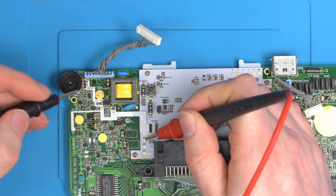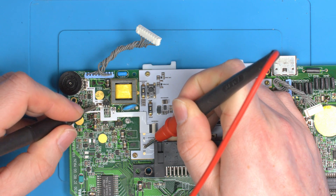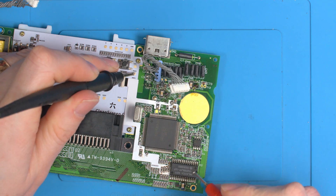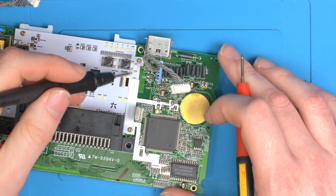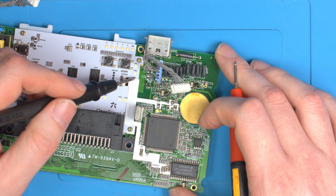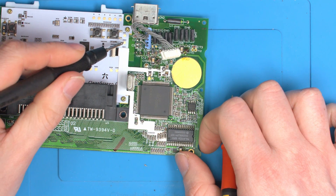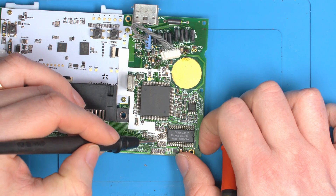Test 5 volts — goes to 5 volts. Test ground — goes to ground. On this side, test left — goes to left. Then Data 0 goes here. You'll notice the silkscreen will be updated to match everybody else's boards on the Game Gear schematic. Originally the labeling read 0, 1, 2, 3 in order, but the ribbons have now been updated to read 2, 0, 3, 1. On the board here it still has the old labeling 0, 1, 2, 3 — so that 0 on the board is 2 on the ribbon, and so on.